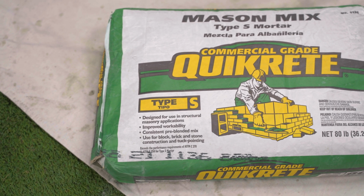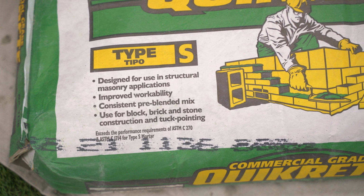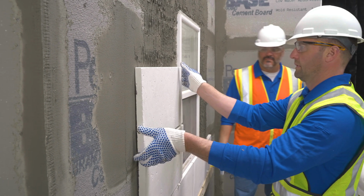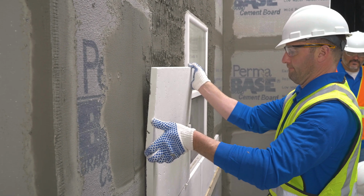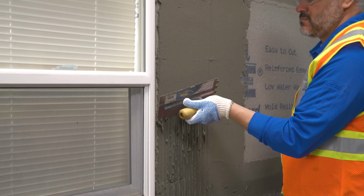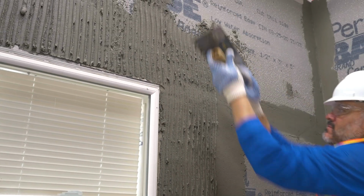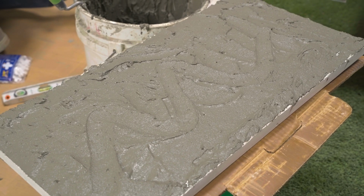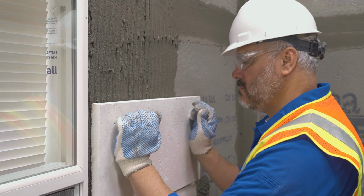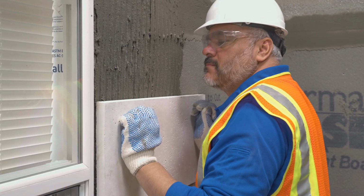If using a building code minimum mortar such as ASTM C270 Type N or Type S, any disturbed unit must be removed and reset. No repositioning is allowed after setting. Modified mortars, when used as setting bed, will typically be applied to a prepared surface by notched trowel in vertical ribbons. In addition, the units are back-buttered and then pressed into the ribbons with a back-and-forth sliding motion. This minimizes sag and increases initial grab.